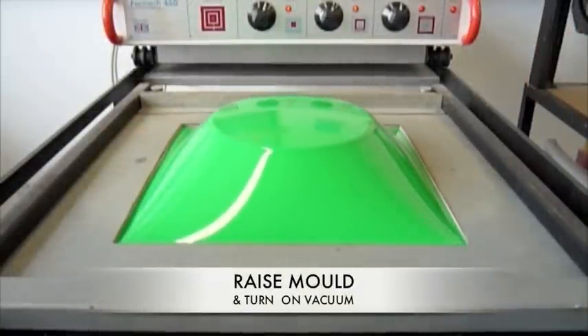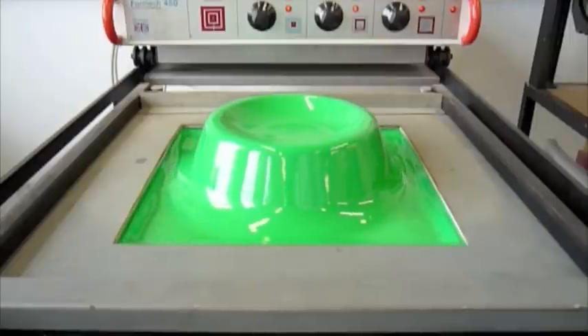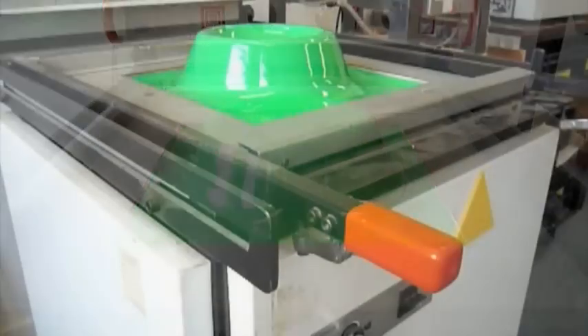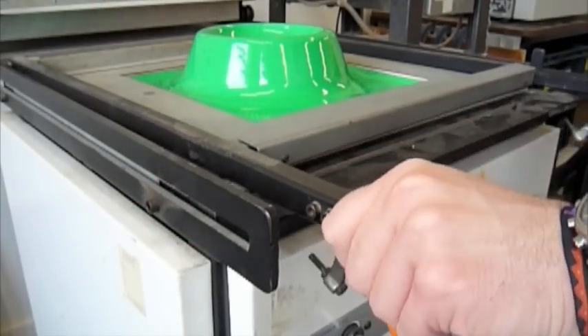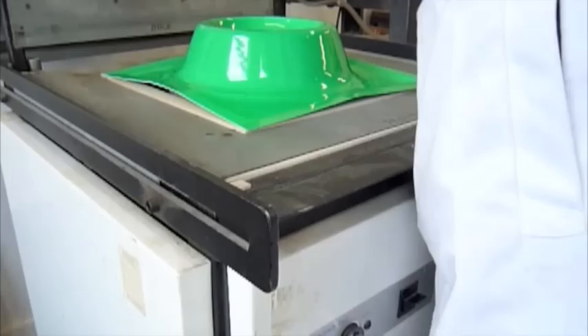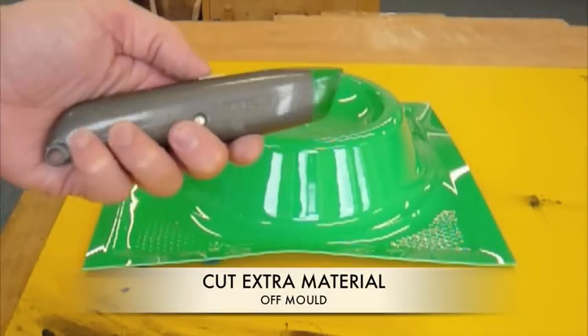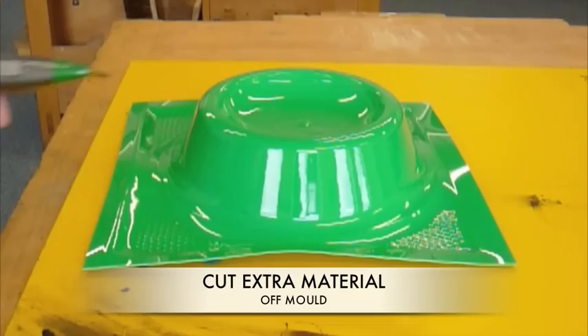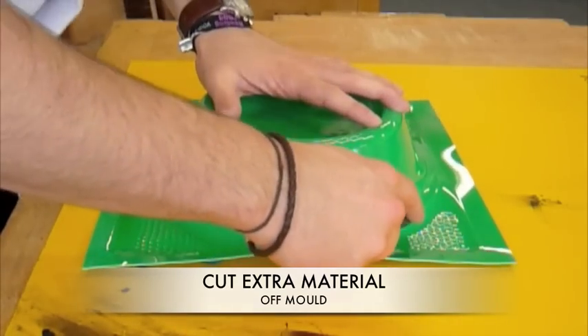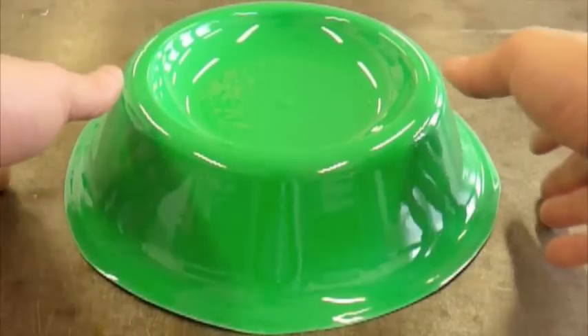Flip the vacuum on and off switch and watch carefully as the plastic is forced onto your mould. When the plastic has tightly covered your mould, use the reverse lever to separate the two. Give the plastic enough time to cool down as it will still be very hot. Release your mould from the vacuum former using the toggle clamps and turn the machine off. Finally, being very careful, you can use a sharp knife and a cutting board to cut the excess plastic from your mould. Congratulations, you now have a perfect vacuum formed mould.